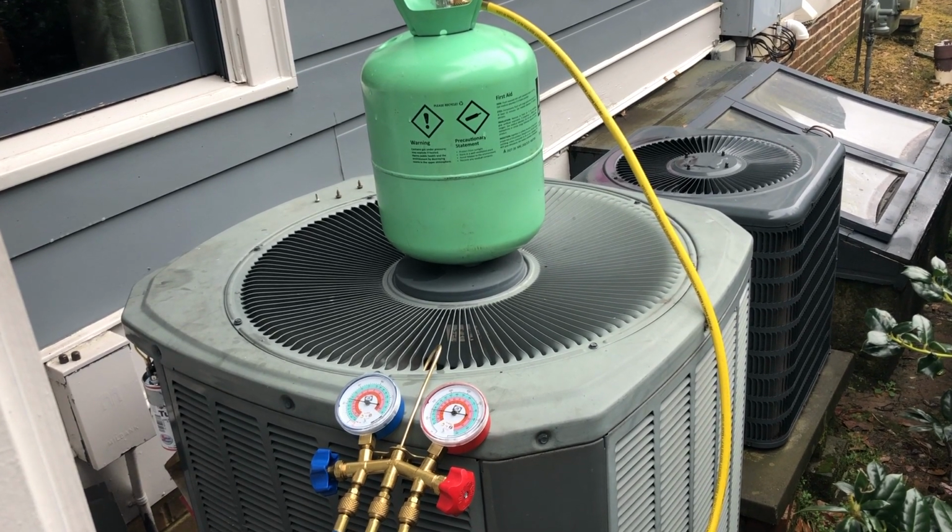Y'all be careful. Another piece of information I forgot to give on that system is it is a zone system, 2 dampers with a bypass that does not shut off 100%, and the system runs over 1 inch of static. So to try to get something tuned in on a cool day like today and low ambient temperatures inside, crapshoot.